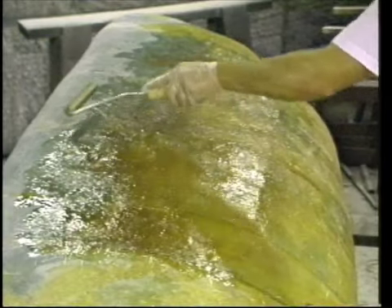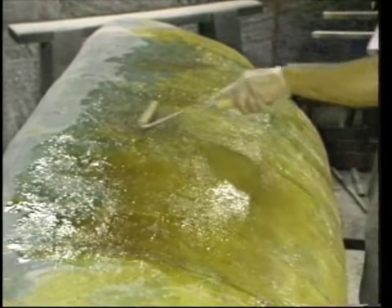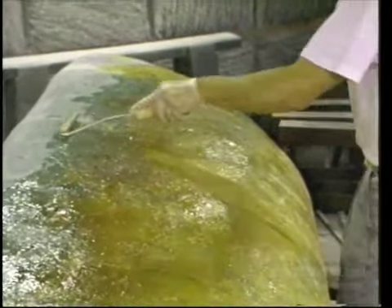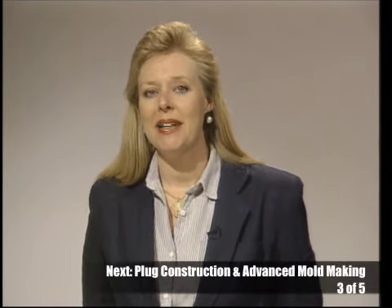This is a demonstration of a groove saturation roller at work. It has no equal for quickly and thoroughly removing air from a chopped mat surface. Look carefully for areas where the fiberglass did not stick to the foam — these areas will feel spongy when pressed and must be cut away.